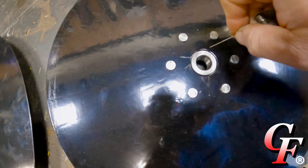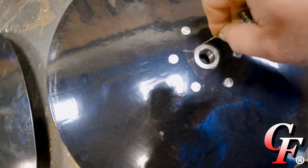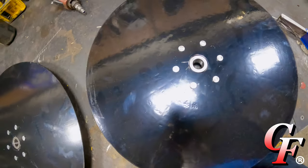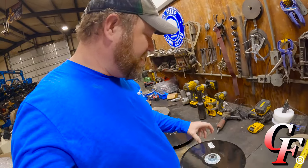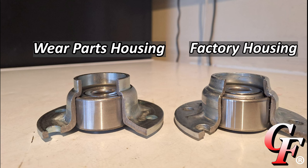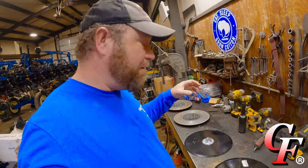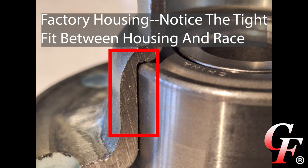Going over here to the Selsen blade, the gap looks pretty much even all the way around. Going into that crack there's just a little bit of resistance at all four corners — that bearing is pretty much dead center, so there should be no wobble in this disc at all. Not only that, their bearing housings are more precisely stamped and machined to offer a more secure fit of the bearing over a greater part of the outer race. I've noticed in past years that factory openers sometimes have a little slack where the bearing is wiggling back and forth in the housing because it doesn't have near as much surface contact with the outer race.